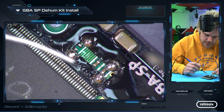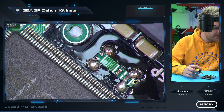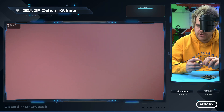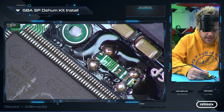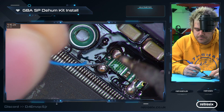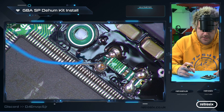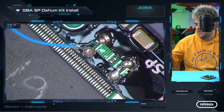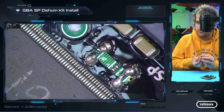We're just going to blob solder onto the pad. Let me just blob it on this capacitor first to fix the board in place. Because this doesn't have a capacitor, you can use a little trick and just bridge the gap with a bit of wire — we sell this in the store, or just use 28-gauge wire, ideally no thicker than 26. Then just place the wire onto the little pad and blob the solder in — it acts as a natural bridge.